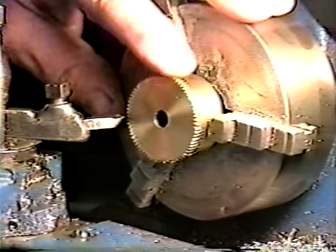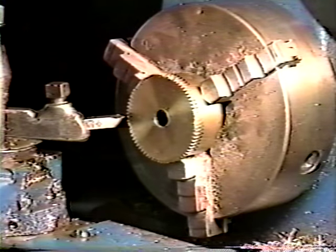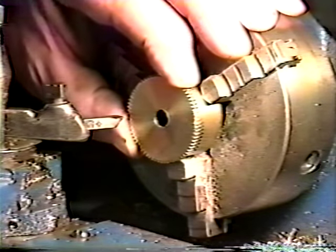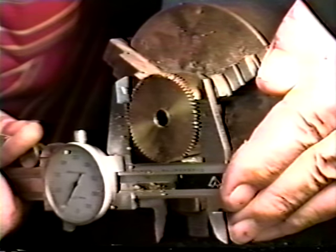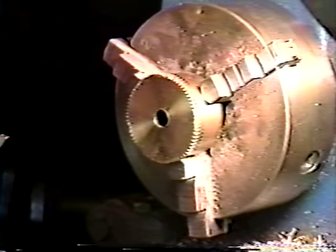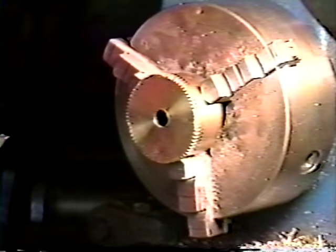This is the barrel that's been broken, damaged. It's got damaged teeth, as you can see, all the way around the barrel. What I have done is counted my number of teeth, which totals 72, and then I took a reading of the OD of the ring, which reads 1.610. I put that all down on a piece of paper so that when we get to the final analysis, when we cut our gear, we're going to wind up with that same number on the gear ring.